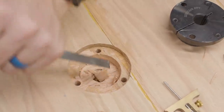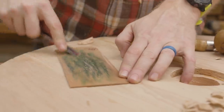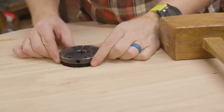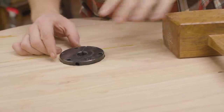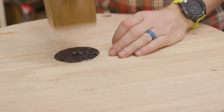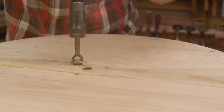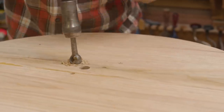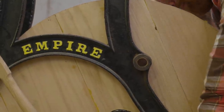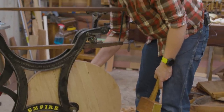The inside also needed to come down another quarter inch. It's nice to have a strop on the bench so you can keep your tools sharp rather than going back to the stones — keeping them honed makes it quick and easy. I tapped the hub down into place and countersunk the bolts, because originally I was just going to have bolt heads sticking out the other side, but now I had to use countersunk flathead bolts.